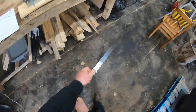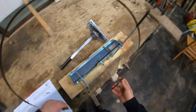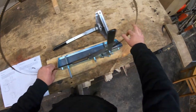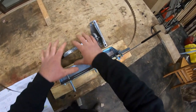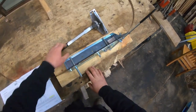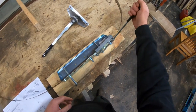What I did was basically take a workbench, put a board down — this allows the blade to ride on it as I'm rotating. As you know from the Woodland Mills videos, there are some slots here and you've got to get the blade to go in. Nothing too fancy — you can see it slid right down in there. There are some adjustments — you'll read the manual — which basically set how high the blade sits. I mounted the metal part of the setter to a piece of wood, which I then screwed to my workbench so it's nice and stable. As I'm rotating the blade you can see how it rides in that nice flat plane.